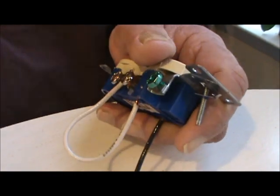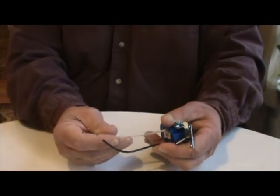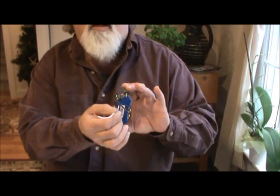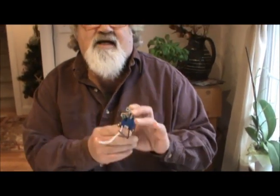You just have to separate the ones that are working from the ones that are not working — process of elimination — and see if you can find which wire is open. Be careful, because the first one you pull out is probably going to be hot if your panel box is not marked properly, so use caution. A lot of times when you pull it out, these white wires will just stay right in the box and won't even come out, and then you'll know exactly what's wrong.